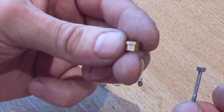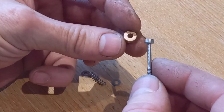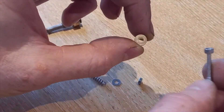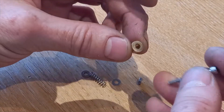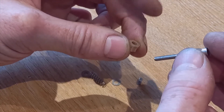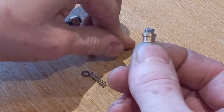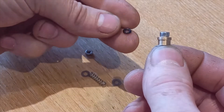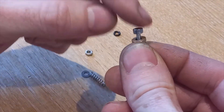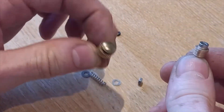I'm going to take the bushing — a little piece of 8mm brass bar, taken down to 7mm for that section — and the hole in the receiving piece is 7mm. But you don't have to do that; there are other ways of assembling this. I'm making this so that it can't be removed very deliberately. Also, because this is going to be soldered in place, I'm not going to put the rubber o-ring on just yet because it will melt. I'll pull this up afterwards and put it on over the top — that's why I've gone for a small head in comparison to the original mushroom style, so you can retrofit these.